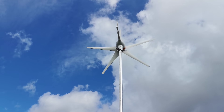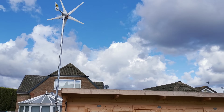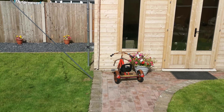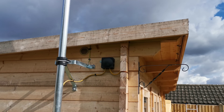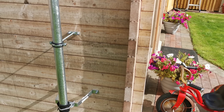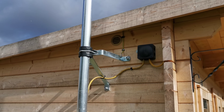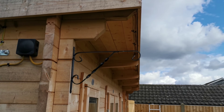I mounted it on a 16 foot scaffold pole on the side of our summer house. The only legislation about these wind turbines — I'm speaking UK now — is the bottom of the blade must be higher than 14 foot. So I got a 16 foot scaffold pole. I did a belt and braces on the bracketry: two large brackets top and bottom, two intermediate mounts and clamps, both lined with rubber to stop vibration. There's a bit of garage floor matting on both of the bigger brackets to stop vibration being transmitted to the summer house. An outdoor weatherproof junction box handles the three-phase AC it generates, with the wiring behind the fascia board.